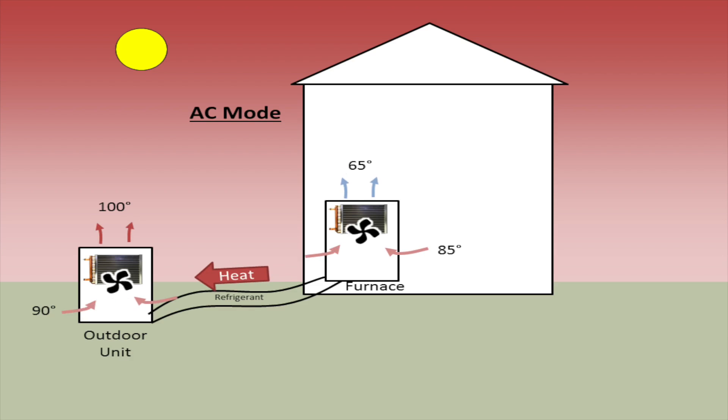I've drawn this diagram to demonstrate roughly how your air conditioning system works when it's about 90 degrees outside. Your house will warm up — in this case I've shown it warmed up to 85 degrees. We cool the refrigerant inside your house in that coil such that when you blow the inside air over it, the air temperature drops from 85 to 65 degrees Fahrenheit. We take that heat using the refrigerant along those refrigerant lines, throw it to the outdoor coil, and we blow the 90-degree air over a warm coil, which warms up that air even more to 100 degrees.